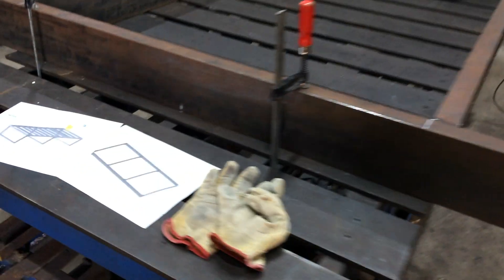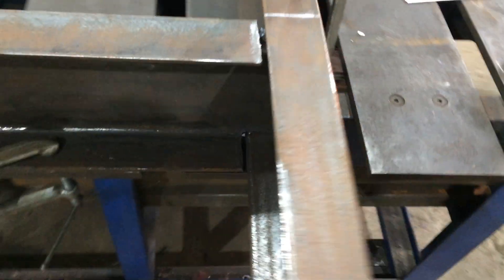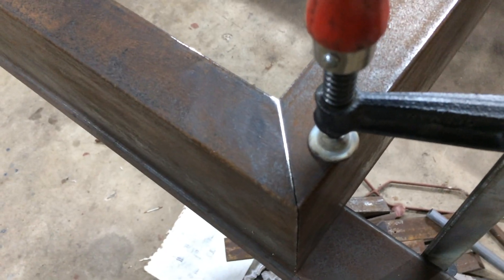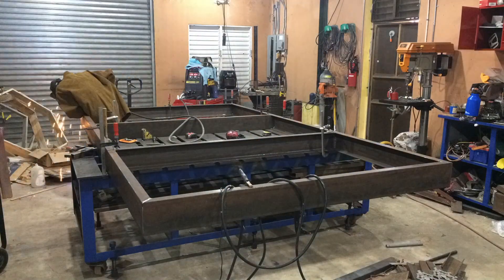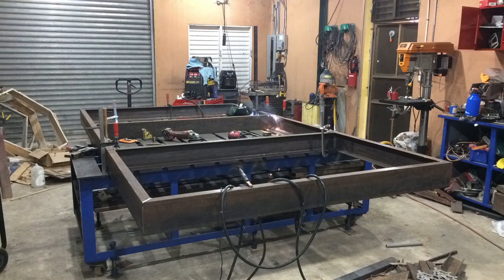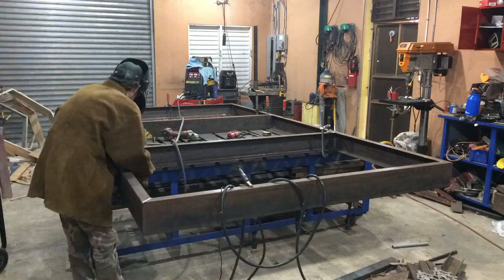Right now I have this frame — I'm planning to add more pieces across but they can be out of like inch-and-a-half by three. I've notched out all of these with the plasma cutter, and over here they're just mitered at 45-degree angles with a little magnet switch in there just helping hang on to it. The bandsaw does brilliantly on making the miter cuts, so it makes for much easier layout and work. Obviously it is my first CNC machine, so we'll see how it comes out — it's a lot to learn, but maybe you can learn from any mistakes I make.